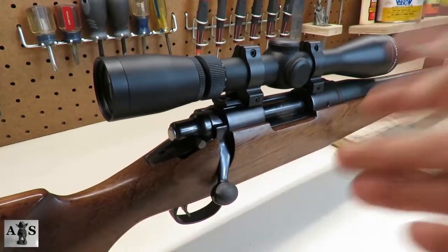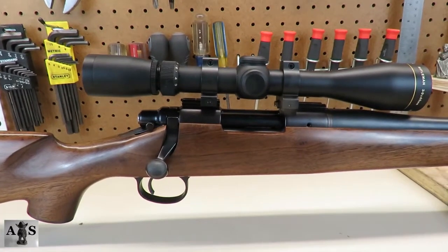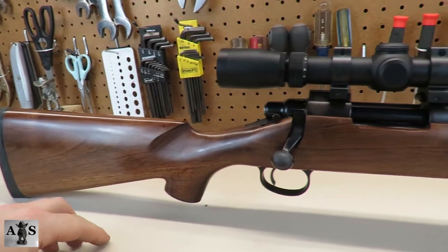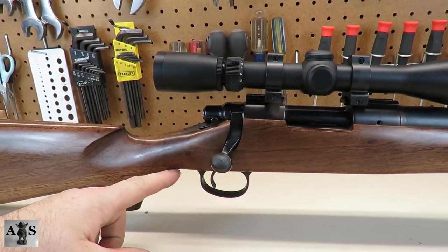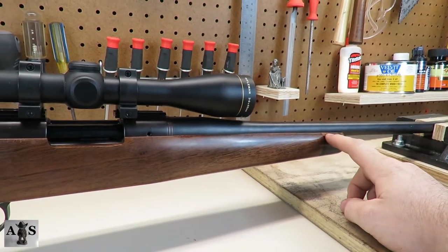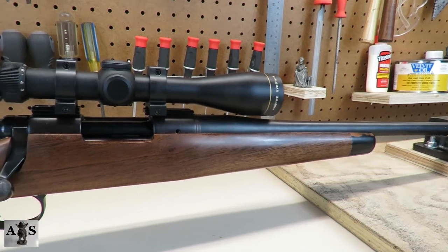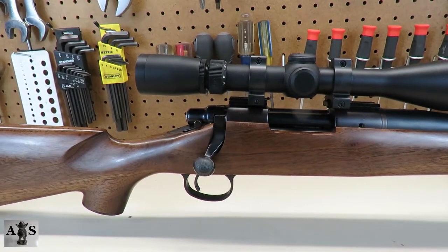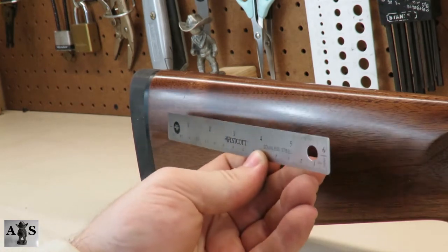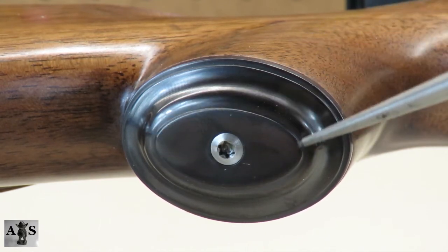You've now completed the assembly of the rifle. Now we're going to jump into the review. This happens to be a rifle I actually built myself, so I take a lot of pride in it. The only thing I started out with was the receiver — I had to shape the stock as well as machine a brand new barrel. I decided to chamber my rifle in 7mm-08. Once I finished machining the barrel to the receiver, I had to fit the rifle to the stock. I decided to leave the blonde stripe on the end of the ebony tip. Everything is fit properly and tight to this action, and the recoil pad fits perfectly to the stock. I spent a lot of time polishing the grip cap — I wanted to make sure there was no pitting before I blued it.